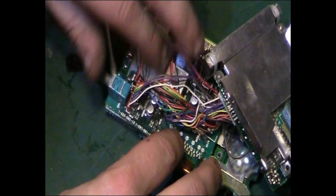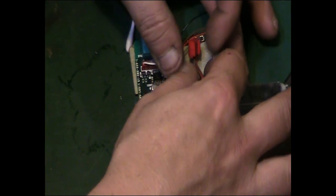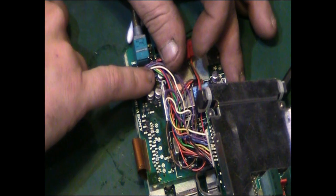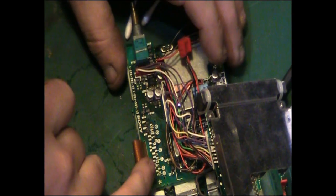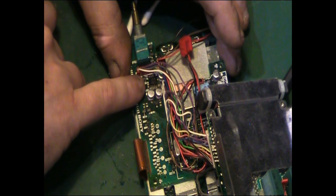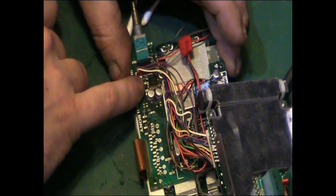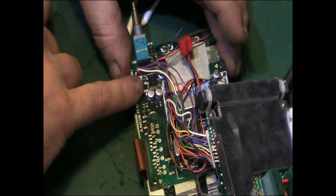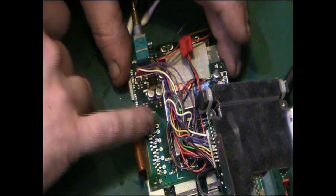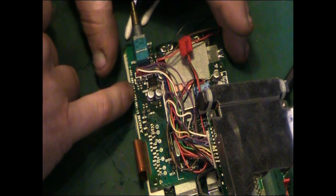is those two capacitors there and that capacitor in there, and I can already see straight away there's a little IC there which I guess is an op amp or something similar. It's a little 8 pin IC there, and the legs on it do look rather furry. I can see a lot of damage in this area from the electrolyte, so this is going to be fun.